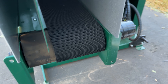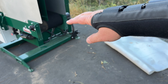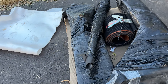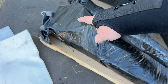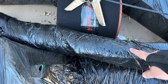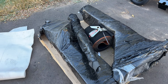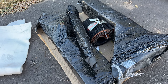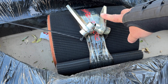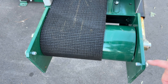When we ship a machine like this we will have a pallet with the excess parts, and we're going to get these things padded and wrapped up on this pallet. Here is the outfeed chute — this is actually two sections but it's already bolted together so you don't have to mess with that. The bolts that attach the chute to the machine are actually on the machine right now — you can see them here. These four holes down here do not get used with the standard chute. There are some bolts that stick out here to allow a gap, which makes it so you can lift up on the end of the outfeed and whatever dirt and debris will fall out. Basically you need to install the two bolts there for the outfeed.